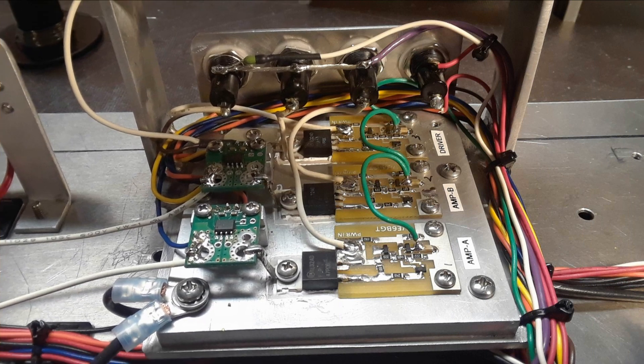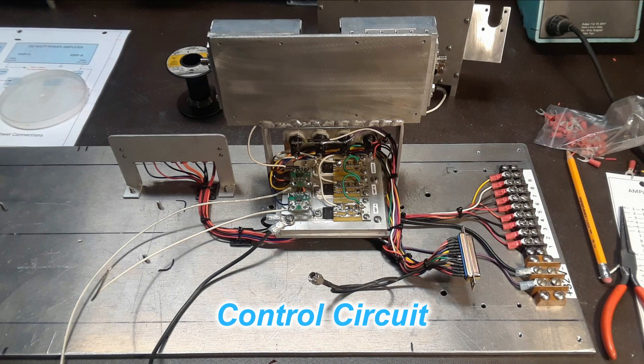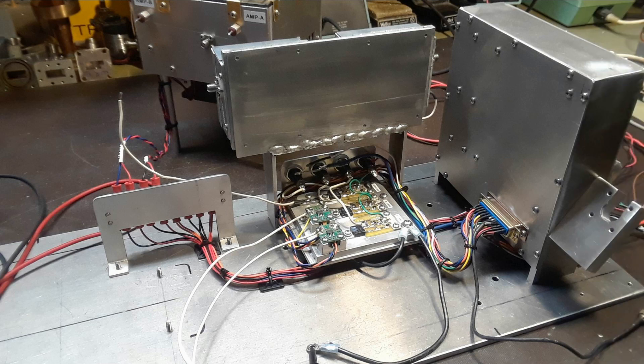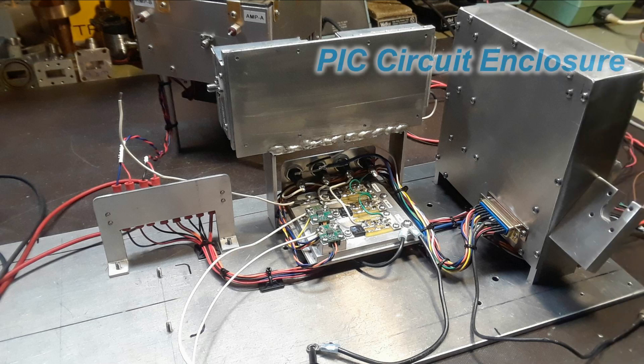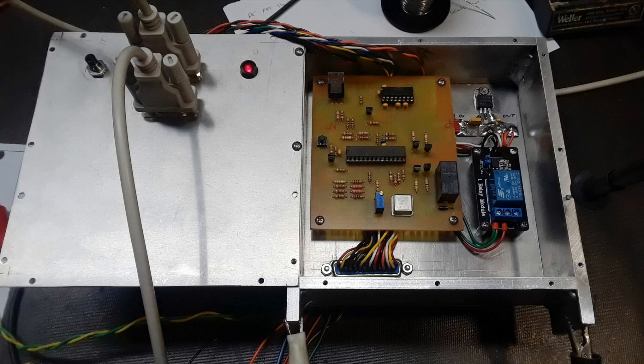This little circuit module is getting wired into the rest of the circuitry, into the fuses, and it all leads up to a DB25 connector which plugs into the back of the enclosure where the PIC circuit sits. The PIC circuit, just like all the other feeds I've built, monitors the amplifier current and draw, controls the fan, monitors the temperature and voltages, and sends data back into the ham shack so I can see it all on the Visual Basic screen.